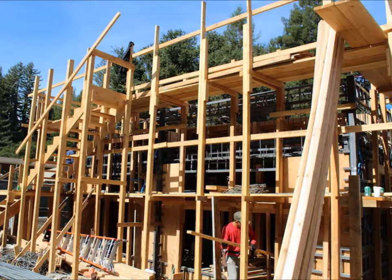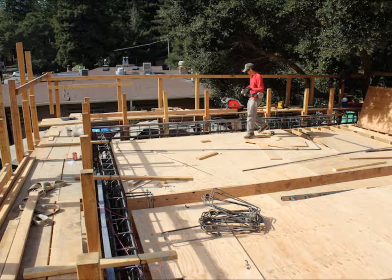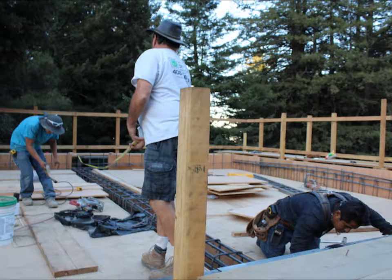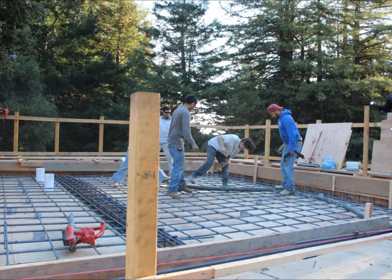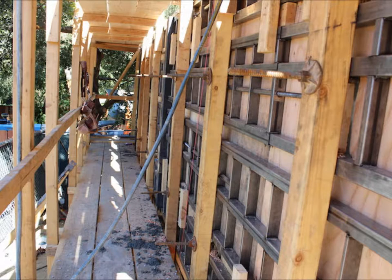With the ceiling form in place, the core form has been completed and work can begin on the roof. We survey in reference lines at the top of the roof and verify that the dimensions for the building are being held. The rebar for the roof and the large ceiling beam is structurally tied in to the rebar for the concrete beams at the top of the walls. With the roof mat in place, all of the reinforcement for the structure has been completed. The last step in the forming process is to install the ties that couple the jacket form to the core form. An advantage of the multi-flex forming system is the relatively small number of ties required — only 60 ties were needed for the entire building.